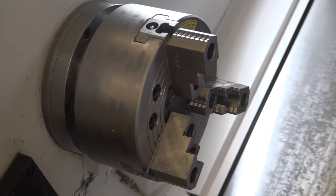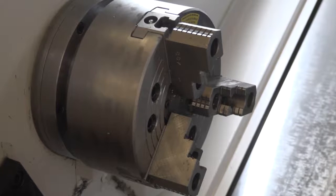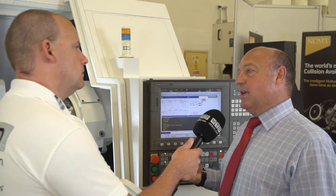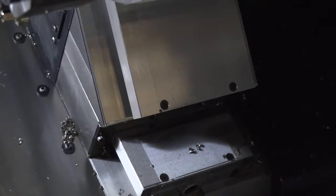What about your spindles? All spindles are Okuma-designed spindles of differing types. A lot of Okuma spindles are direct drive Prex motors. The Genos range is being upgraded to include all Prex motors with direct drive. The range has also been expanded to include M-function, Y-axis, and W-axis sub-spindles.